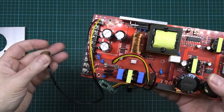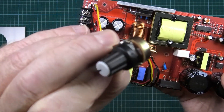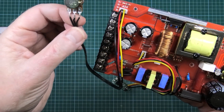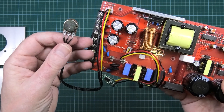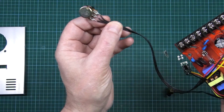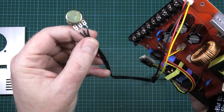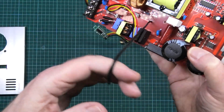The first thing you have to do is change the variable resistor on the current adjustment. This is a 5k pot - I'll leave a link in the description for all these parts. Basically it's just pin-for-pin: the yellow goes to the left pin, the black goes to the middle pin, and the red goes to the right pin as you're holding it. So that's just a 5k pot replacement.